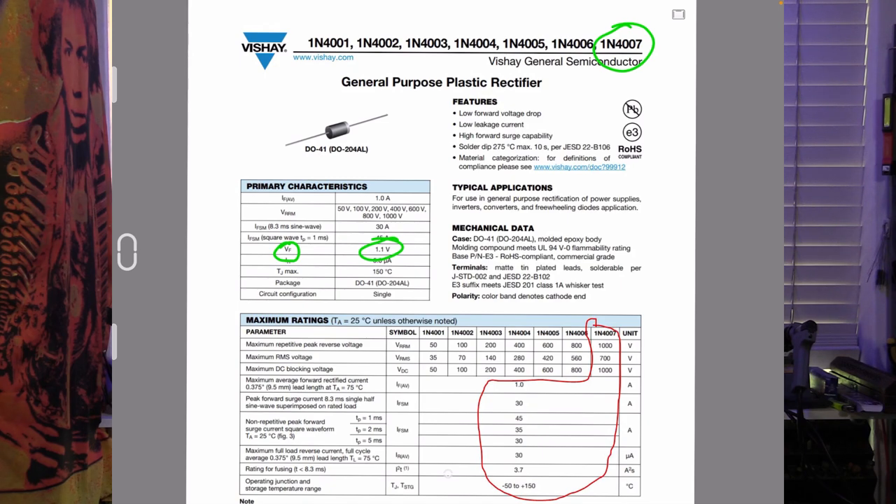Let's remember this as the gold standard or wooden standard, depending on whether you like sag. It doesn't drop any voltage at all, and it'll hold that. This tiny voltage drop tells us that if there is any sag in an amp with a diode rectifier, it ain't coming from the diode.